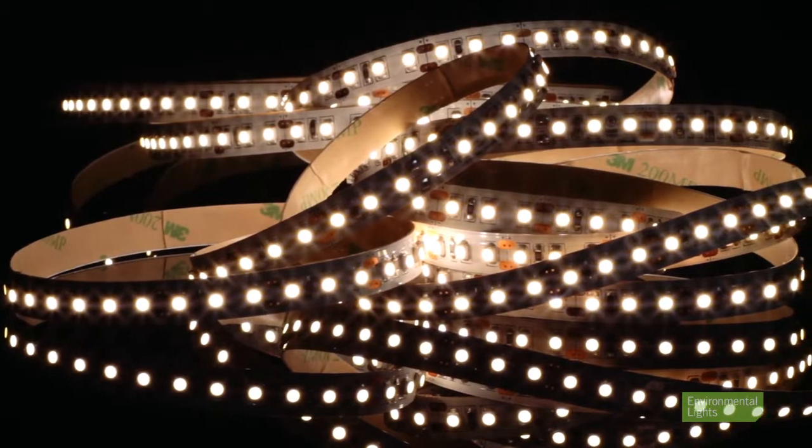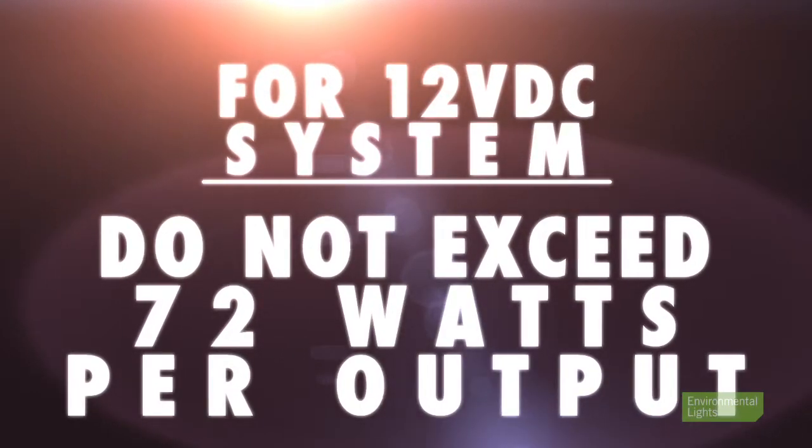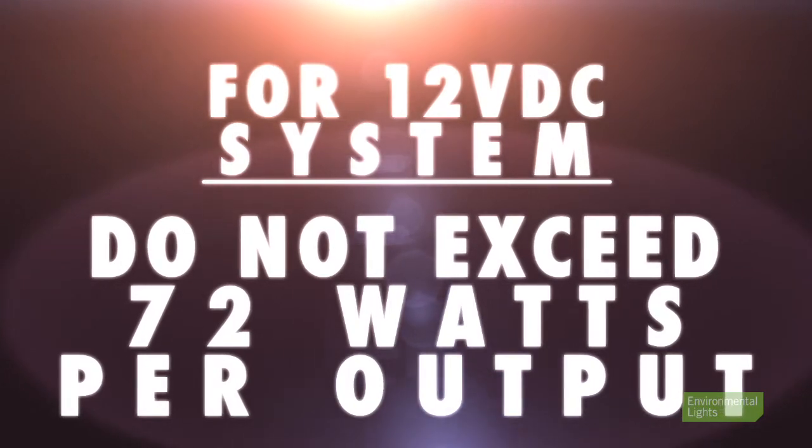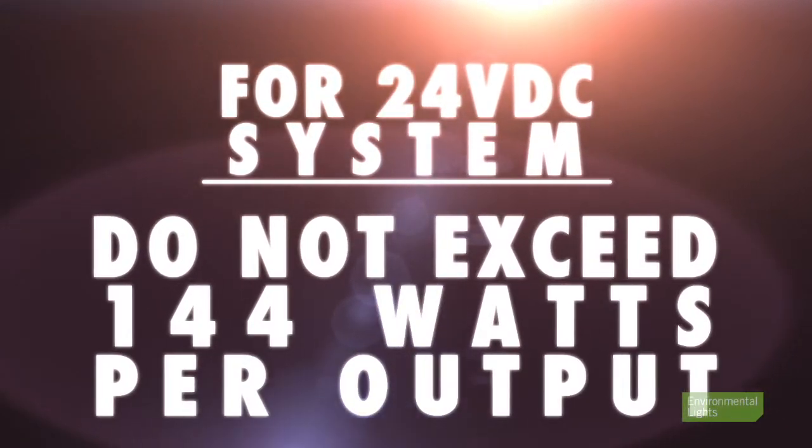Lastly, we have our single color LEDs. Now, our LinkUp controllers have a relatively high capacity. However, there are limitations to how many lights we can power on each receiver. If you are controlling 12 volt DC LEDs, you should not exceed 72 watts per output, or 144 watts per controller. If you're controlling 24 volt DC LEDs, you should never exceed 144 watts per output. That's 288 watts per controller.